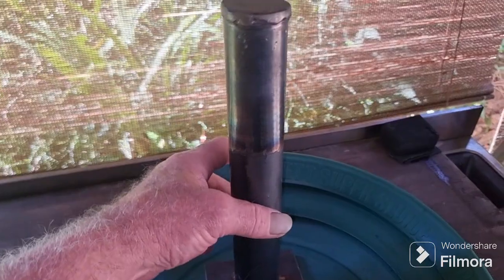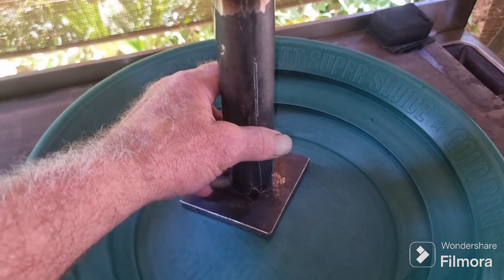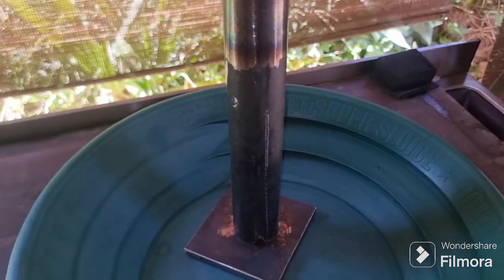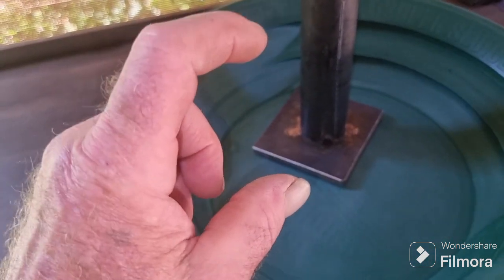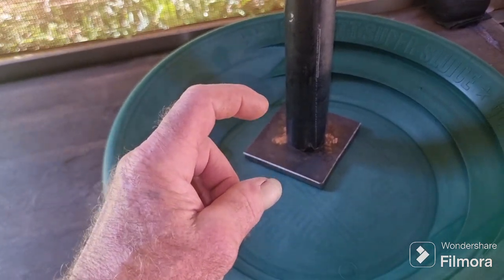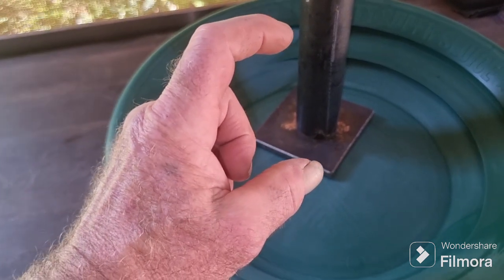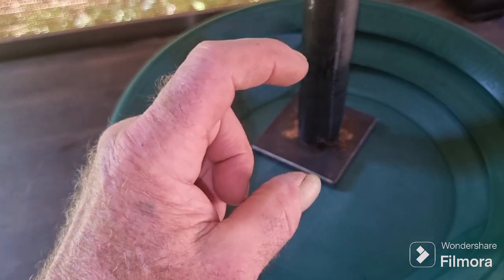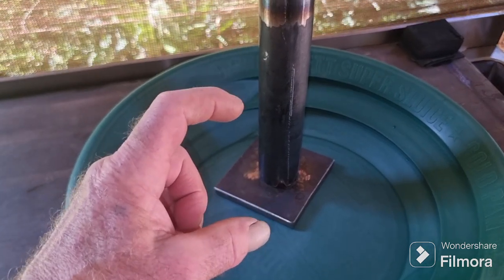So that's my homemade retort. We did do one retort with it just as a test — the mercury was released, turned back into mercury balls at the bottom. I'll put it back into a jar under water — in a glass or plastic jar, can't have metal otherwise it'll eat its way through. So it went into a glass or plastic vial with a lid, in water, so it's inert. When it's in the water it's not going to really harm you because there's no gases getting out.